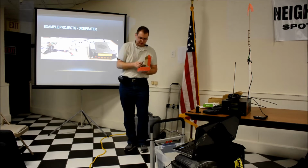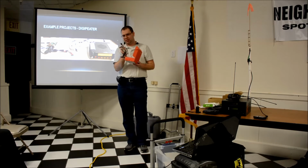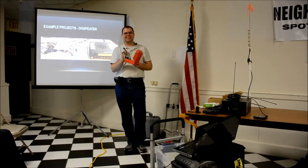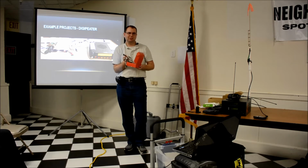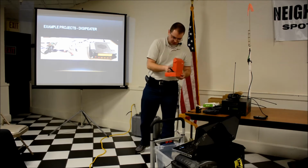What I currently have been using is one I had to solder onto a little pin and kludge together because, for some reason, they didn't break out CTS and RTS. They broke out CTS and DTR. And the software I'm using uses CTS and RTS pins from the serial port to control the radio. So I'll pass this around. You can see what those are.